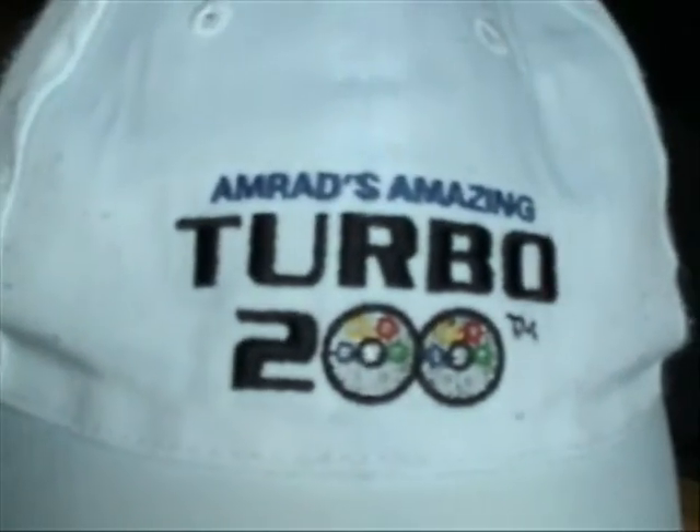Here's the difference: the larger one is rated at 440 volts and the other at 370. Now, why would a manufacturer make a run capacitor like that? Why would they bother to make one rated for 370 and one for 440? Well, there's a reason — each motor is rated differently. It all depends on whether the motor or compressor you are installing is rated for 370 volts or 440 volts. So this one is 7.5 at 440 and this one is 7.5 at 370 volts. Let's say the motor you're installing requires a 7.5, 370-volt run capacitor, but you don't have one — you only have a 440-volt run capacitor. Can you use it? The answer is yes. You can never go down in voltage, but you can go up.